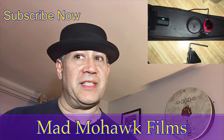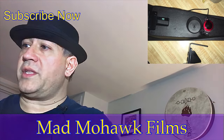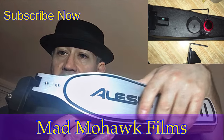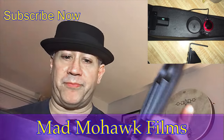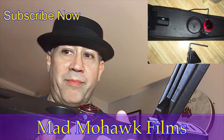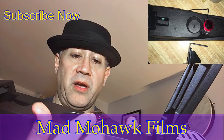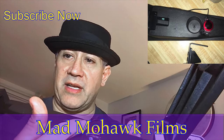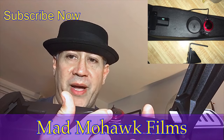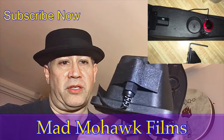Here's that assembly with those two screws, and there's the pad that hits the internal section that triggers the hi-hat open and closed. That's the spring. Once that's removed, you now have the ability to open it up. I simply used silicone to attach this rubber, and this is a simple piezo trigger — under three bucks on Amazon.